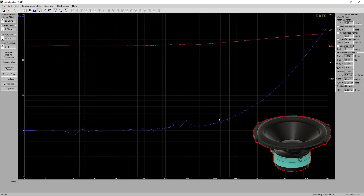We're in DATS now, looking at the overall Thiele-Small parameters of the speaker. The MMS is a little off — it should be higher, and I believe a lot of this is caused by the coil touching the pole piece in the motor. This should be a spikier graph — it should spike up sharply, and the rough shape indicates there were some issues in taking these measurements. Take all of these with that in mind.